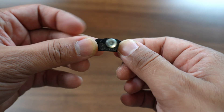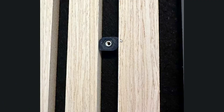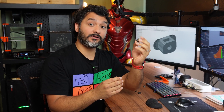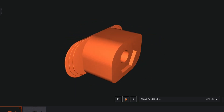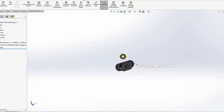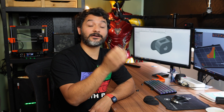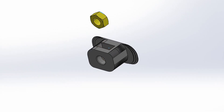Now let's install the decoration on the wall. For the decoration, I could drill directly on the wood panel, but instead I will use this tiny part. I love this part because it's very useful — you can install it between the two wood rails, and because of the pressure, the part will stay. I found this model on Printables, but the only thing I didn't like was that it used an M3 heat insert, and because I'm not good at installing heat inserts and I would need to order them from Amazon, I decided to modify it using SOLIDWORKS. I used an M4 nut and M4 screw instead, because these elements are easier to find in your local store. If you are interested in using or modifying this model, I will share the STEP file and the STL file in the description below.